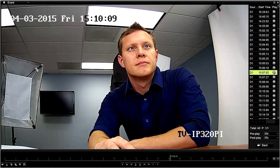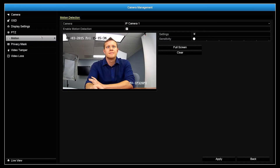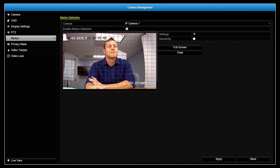We also talked about the need to complete Motion Detection Setup from the main menu. To do that, let's go to Camera and select Motion. Camera 1 is selected by default. We can pick any camera from the drop-down menu and create a Motion Field of any shape. To remove Motion Fields, click on an area with Motion already defined and you can see it was removed. A timestamp overlay will not trigger Motion Recording, so you can create Motion Fields over it. The second very important step is to move Sensitivity from off and slide it to the right. If we don't do this, Motion Sensitivity will be off even though we set up the Motion Fields. Click Apply, and now Motion Detection Recording will work for this camera.